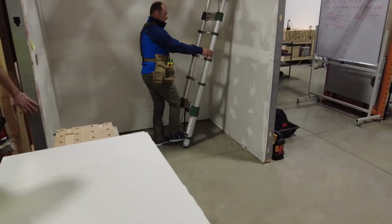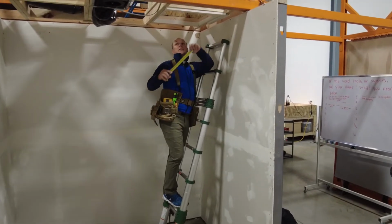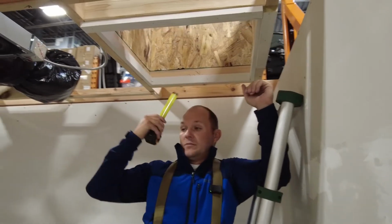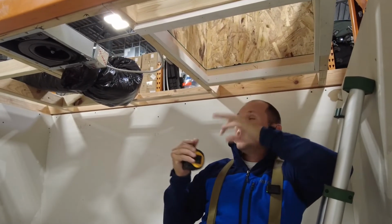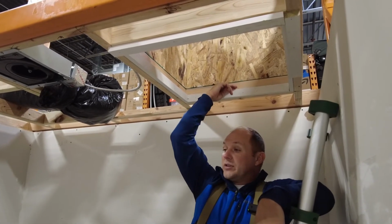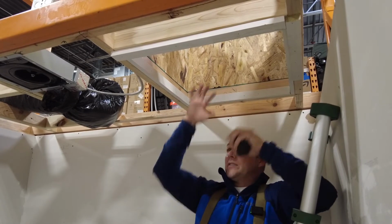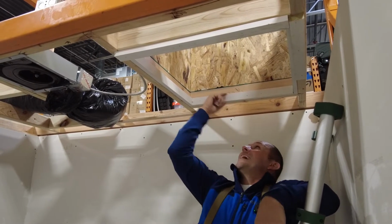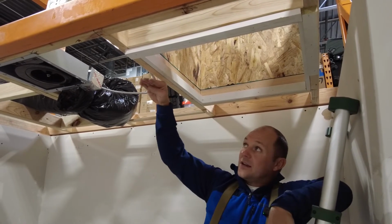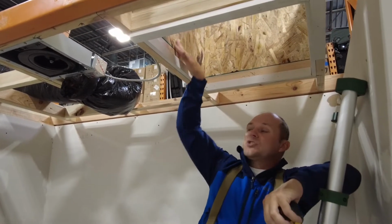So this piece you're already gonna have typically, the attic hatch. A lot of times they're broken, a lot of times they're not, whatever. But if you notice, that attic hatch fit in this hole. We didn't make this hole smaller. A lot of folks that do this type of work, they'll take this damming and they'll run it all the way down to the trim. But now what just happened? They made their hole smaller in each direction, an inch, 1/2 inch on every side, and you just covered up all your reveal for your trim. So now you're gonna have to put more trim on, and your existing trim's way back here, so now you're gonna tear it off, put big wide trim on, just go flush.